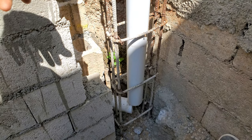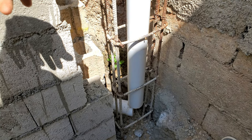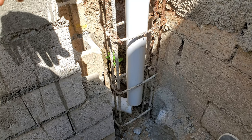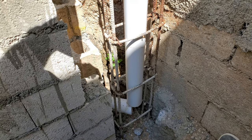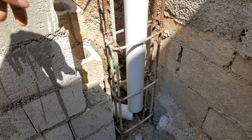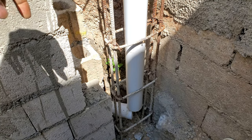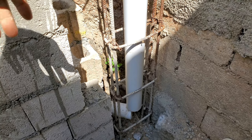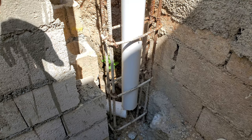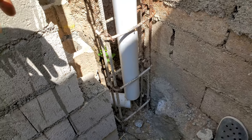We're going to use a 45 down this one. I have a 90 degree elbow on it, but I never get the flow I want. I just want it to run down and dash out. I want it to run down and have it slow down in the bend, and then more water going there to help it out. So 45 down there, and just dash it out.